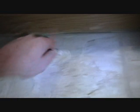I just have to do length cuts now. Let them in under this island area here. What I did, I took this piece, I'm putting it in the other side so I can make my mark, and all I did was square it off to these lines. This is actually reversed from how it's going to go on, but I made my mark to the side that I'm taking off, and I'll make a long cut with the square, and it seems to score pretty easy. You just go light 2 or 3 times and it breaks right off, not a problem. And once I make that cut, that'll be the side that's butting up to there, and that'll just lock down.